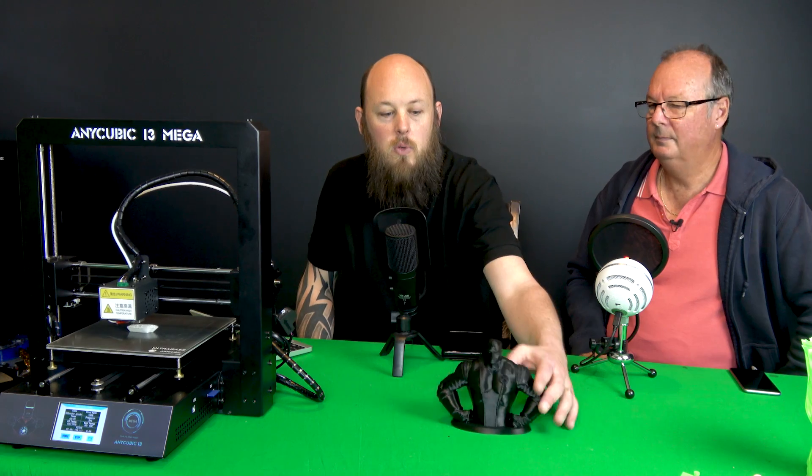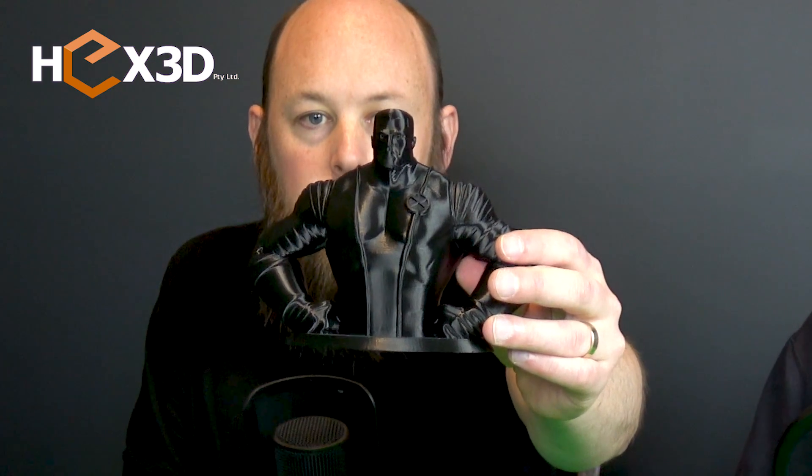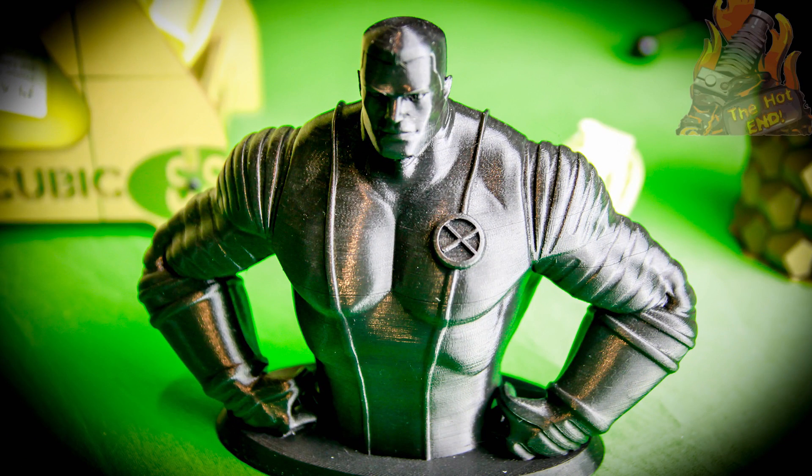As you can see here, we're printing a Benchy — I've got that going at about 50mm/s at the moment just to keep the noise down. 50 is a good midway point to get excellent print quality. The Zortrax prints at 30 or 40mm/s to give extra detail. Here's a model — Jeffro's Colossus — printed with no supports at all at 100 micron. All the detail is there, and that was about a 13-hour print.